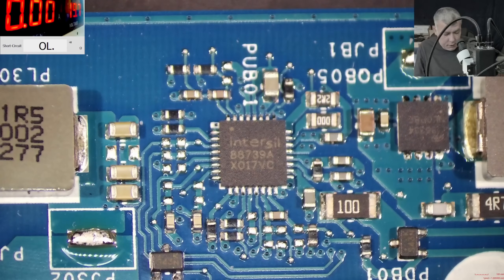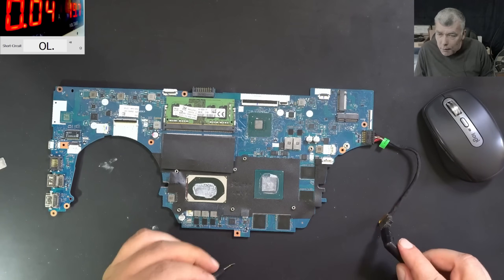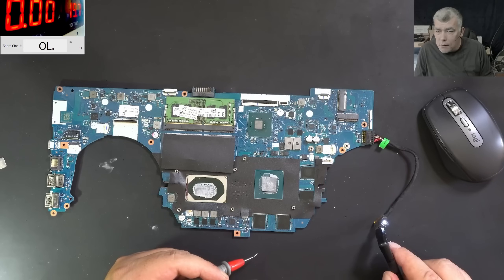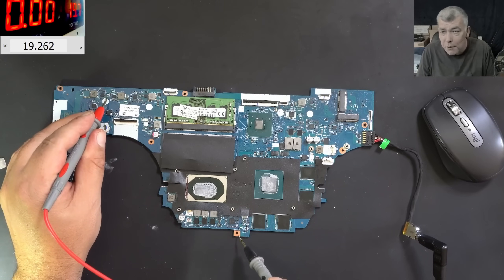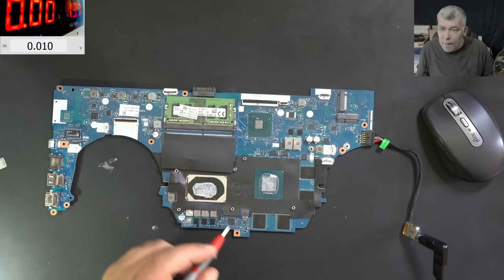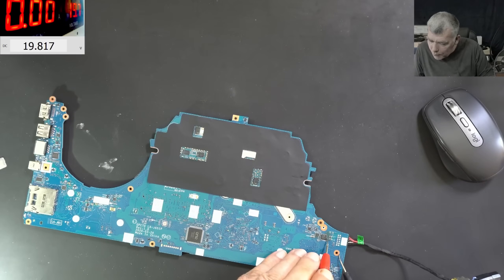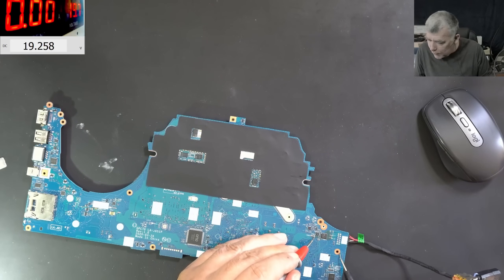Let me plug the power and check this chip. Interestingly, after plugging in, I now have a white light and it's taking about 10 milliamps. We only took the board out. So the main power rail is 19.2 volts — why is that when the input is 19.7 volts? Going to the first two MOSFETs: the input is 19.8, the output of the first MOSFET is 19.8, but the output of the second MOSFET is only 19.2.